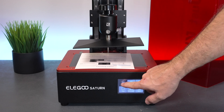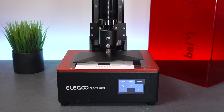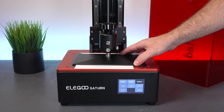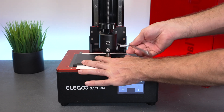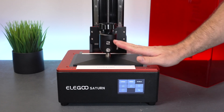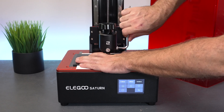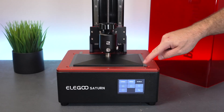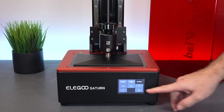We simply need to take this card and put it underneath between the screen and the build plate. Then go to the tools menu, click manual, then home — that's going to lower it down to where it needs to be. You can see it's in just the right spot because it pushed the spring in just a bit. Align it nicely — don't forget it spins around in circles too. Push down on the plate as you tighten the bolts so one end doesn't go up or be uneven. The paper should be pretty tight and the gap should look very even all the way through.